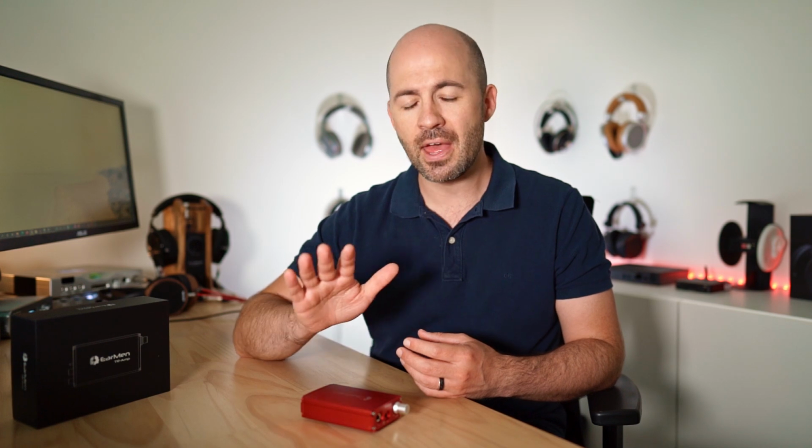If you plug in a headphone like an HD800 for instance, or maybe one of the peaky Beyerdynamic models like a DT990 or even some of the 880 versions, you're not going to have your ears bleeding as a result of the Tramp being too sharp and edgy as some people might think of Sabre DAC units as being. The Sabre DAC implementation in the Tramp is really excellent, and much like the Eagle and the Sparrow, it comes across with a sense of refinement and clarity and precision without ever getting edgy.